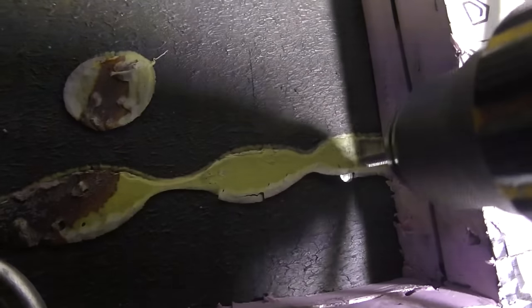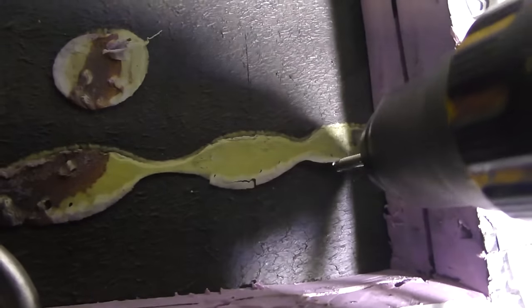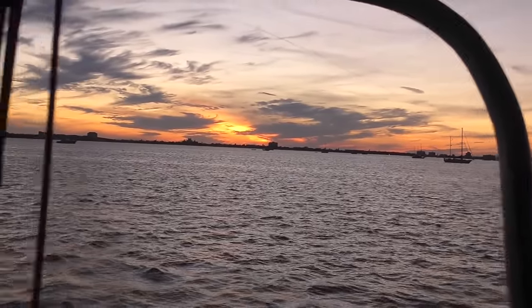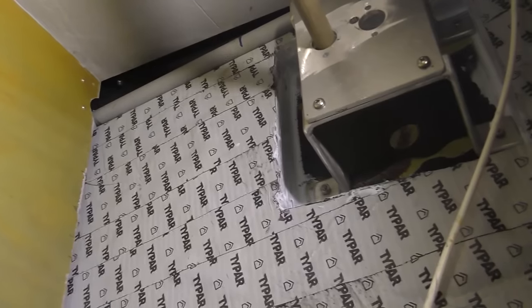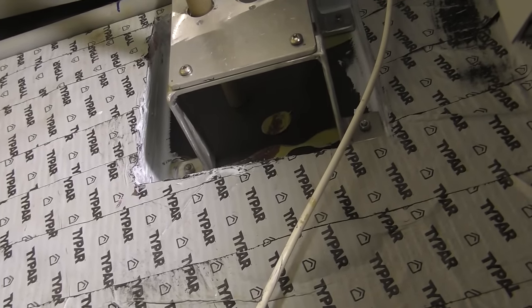The four holes are drilled. Now I'm going to tap them — and I'm not going to thread from this side. The taps are to hold the bolts in place; they'll come from the other side. That's beautiful. These winter days make for short work days though. Try not to fall into the drink. Put a little Never-Seez on the bolt and get the bolt into the hole. The next job is to run the exhaust through the hole too. I happen to have a broom handle — put that through the exhaust pipe and where it touches the hole is where we need to cut.